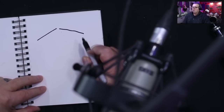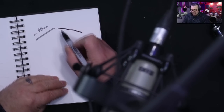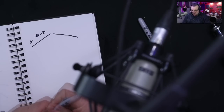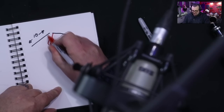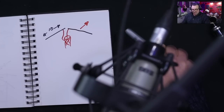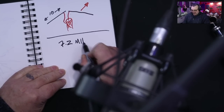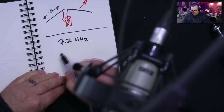A dipole for the 40 meter band — in metric, we'd need an element roughly about 10 meters long. We take our coax, the center goes one way and the braid goes the other way, and that's what makes our electromagnetic radiation. Nigel was saying that a dipole resonant on, say, 7.2 MHz will also be resonant roughly three times that frequency as well.